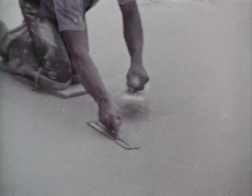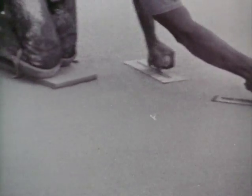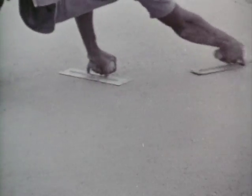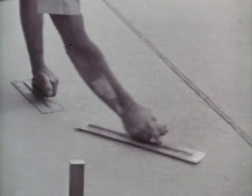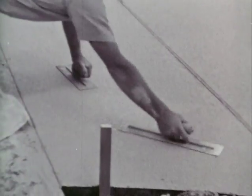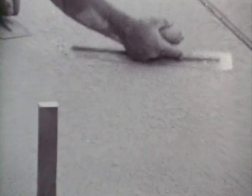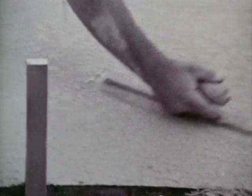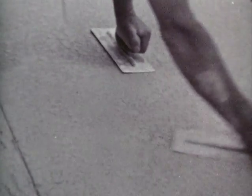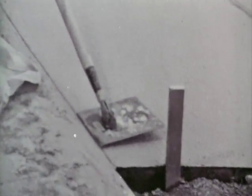The second pass must follow immediately behind the first. While troweling, feel for uneven surface. Wipe away the fuzz with the trowel held sharp. The finished deck should reveal a 40% smooth walking surface and a 60% void surface. This prevents craze cracking, since the knolls may expand and contract from the voids. This process assures a hard, dense, uniform, color-fast deck.